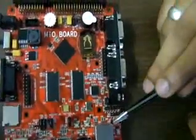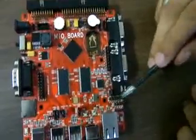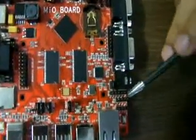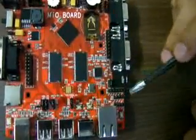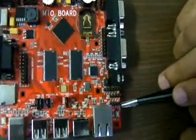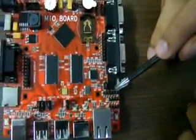There are GPIOs here — general purpose input-outputs. These can also be used as special purpose input-output: these are I2C-0 lines, these are ADC lines, and these are SPI-0 lines.